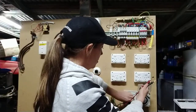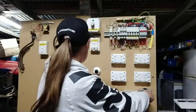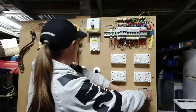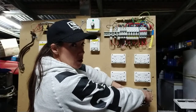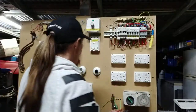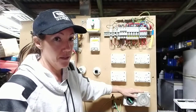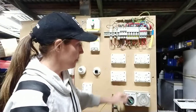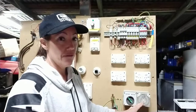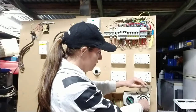Three-phase switch — make sure it's turned on. Go from active to your earth. Got 10.1. Switched it off — I now have no reading, no continuity. That means it's switching off. Later on you're going to be doing phase sequencing, and this is where it gets really interesting. I know this is not wired the way it's supposed to be wired, but I still got that reading and I still know that the live was being switched off. So you would test that for every single one.